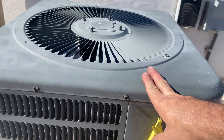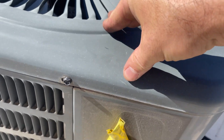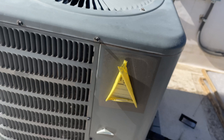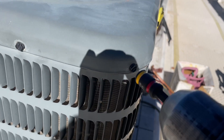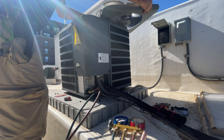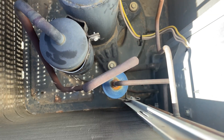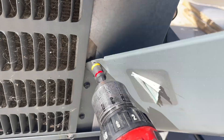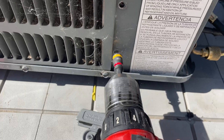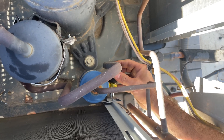I'm going to take off this cover and this cover, and remove the liquid line dryer that is inside of this unit. This is a big extra step, but it's the proper way to do it. Got a ton of 5/16 screws that need to be removed. Here's our liquid line dryer down here — we need to remove that. Set this panel aside. Two 5/16 screws holding in this bracket.